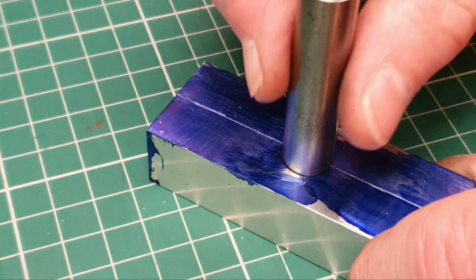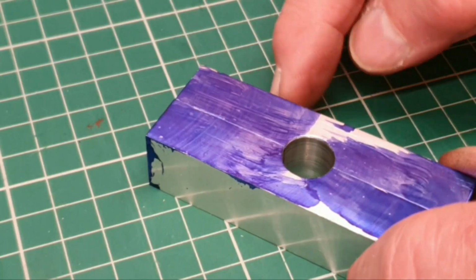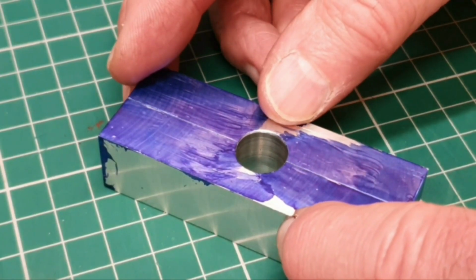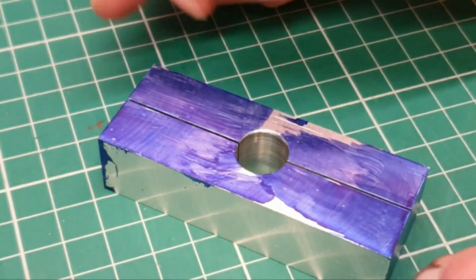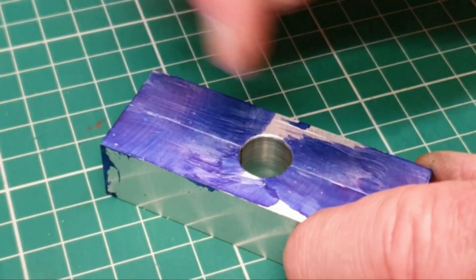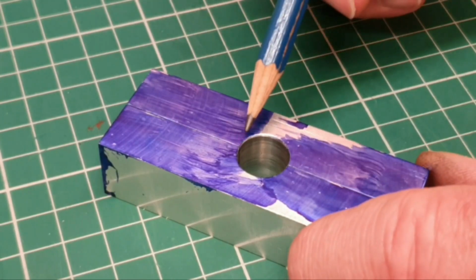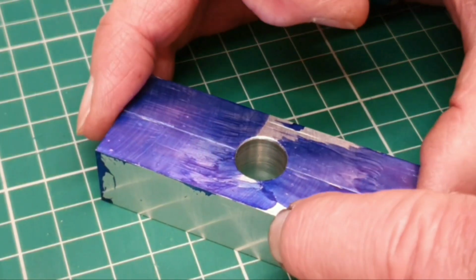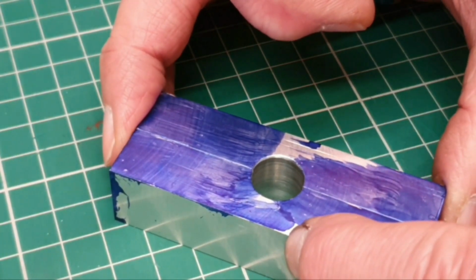I'm going to machine a piece on the lathe so that I've got a flange on each side of this to hold it in position, and I'm using a piece of roughly 3/4 of an inch round stock. I decided that it's best to machine the spindle first before I cut the angles on here, because if I'd cut the angles first, I lose the perfect round shape here. So it's best to do this first so that I've got these two halves to make a final test fit on the part.